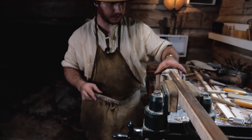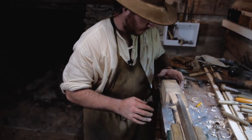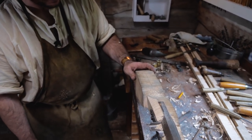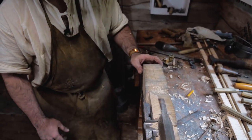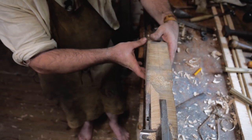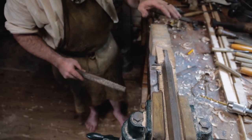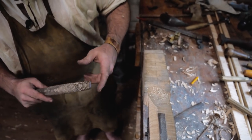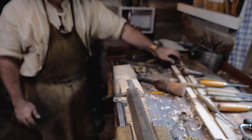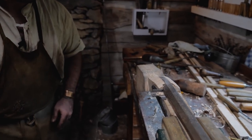We're going to start shaping around the lock plate so we can put the cock back on and work it a little to make sure everything's going where it should. We'll go ahead and take some wood off the top here. You want to leave as much meat on the wrist as you can right now, because you're going to be doing a lot of work on the butt plate when you're inletting it, and also chiseling off excess wood — you'll be hitting this thing a lot. Leave all that meat on there for now. Once you get the butt plate on and the butt shaped, then you can start taking wood off the wrist. Don't get in a hurry — the more wood you take off, the higher the chance of breaking something.